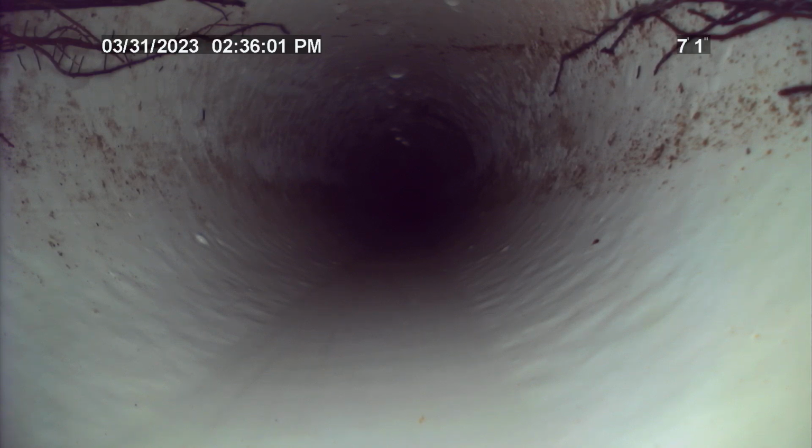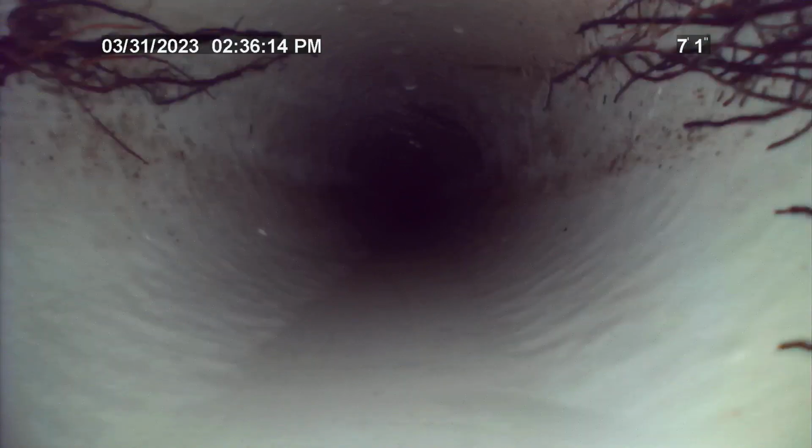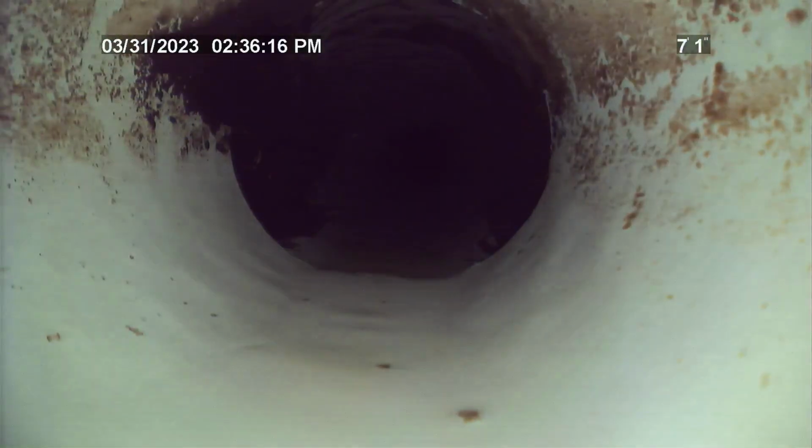This spot was also located outside. This was located at approximately 8 foot deep. All these locates are for inspection purposes only, and the line must be relocated prior to any excavation being done to make the proper repairs.